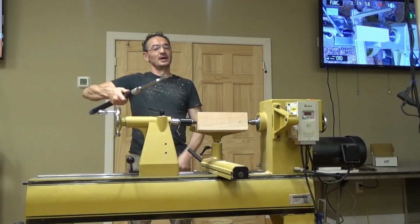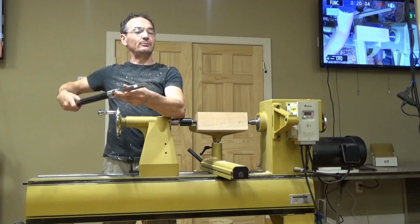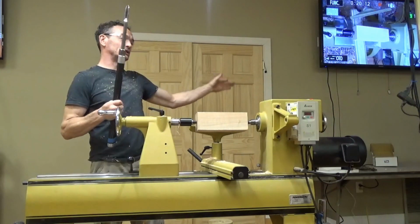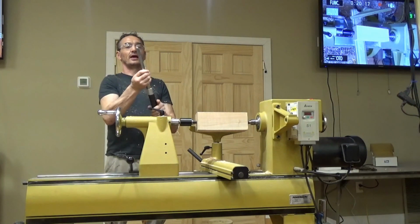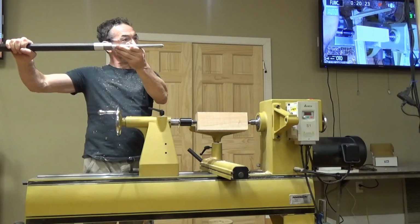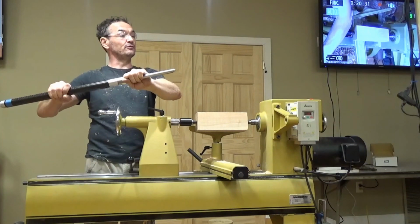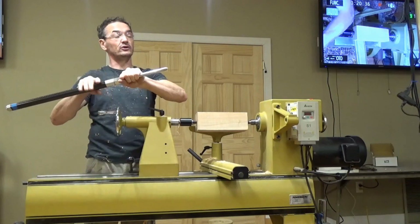If you want to push it, we have to decide, well, today I'm going to push in at this angle, so I'm going to open the flute more. Oh, I want to push that, I'm going to change it. When you do that, the bevel comes on and off the surface. And so where do you put the handle to match that? But if it's 40 all the way around, which is what freehand sharpening does, because you're using a platform and not a pivot system, you're able to adjust. So you notice for the maple, I was a little bit more closed with my flute than I was with the ash. With the ash, I had it slightly more open, but I was still in the bevel. If my bevel was changing angle from the tip to the wing, when I opened and closed the flute to find the magic spot, then my bevel may be on or off the surface. And when your bevel's off the surface, you're not in control of the tool.